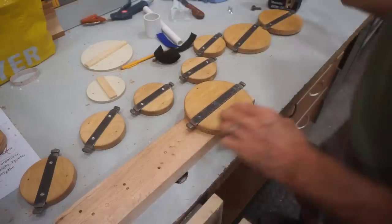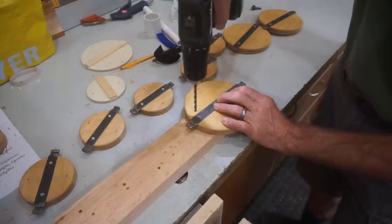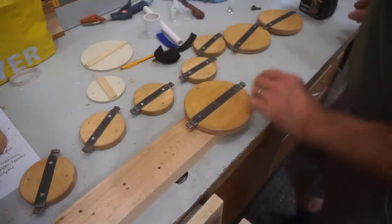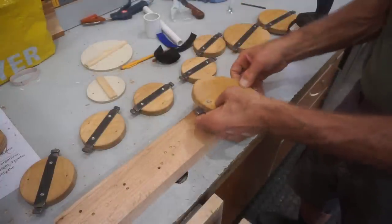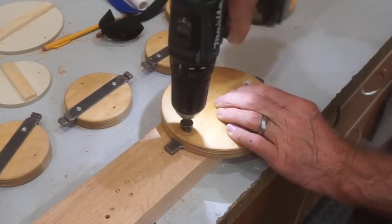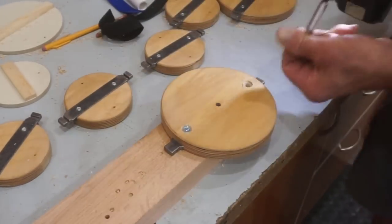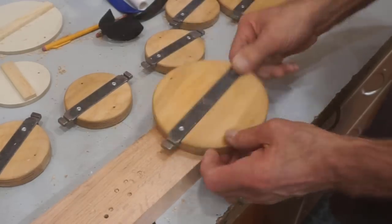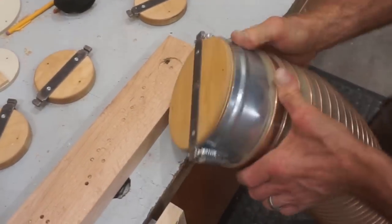After the finish dried, I placed a clip bar notches-up in the disc dado and drilled down through the discs through the tap holes with a number seven bit, then chased the hole through the disc with a quarter inch bit for a clearance hole. Flipping the discs over, I used a countersink bit so the three quarter inch, quarter-20 flathead Phillips machine screws could be driven in flush with the blocks to hold the clip bars to the discs. Now the assembly is ready for a trial fit in the QD fitting, and it looks marvelous.